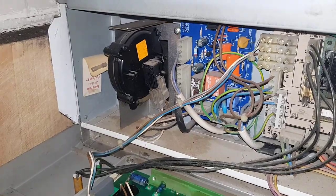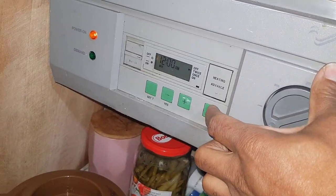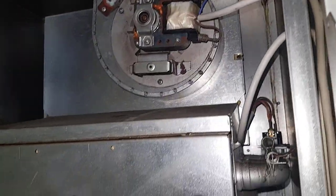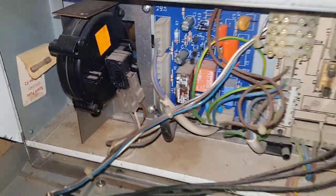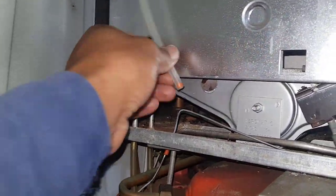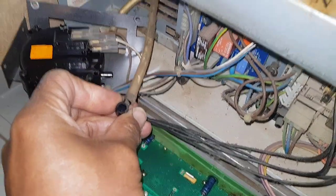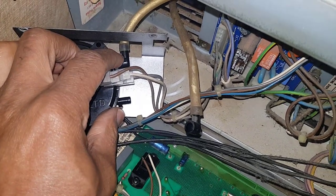Okay, it clicked but we're going to turn the power on to see if it's freed it. No, the fan's still not turning. We're going to take that air pressure switch out and make sure the tube's not blocked. I've tried blowing down it and it's definitely blocked — very difficult to blow down. I took off the other tube and blew down that one — it's free.